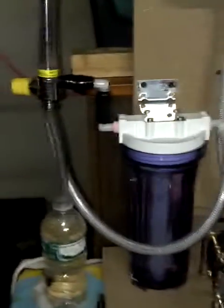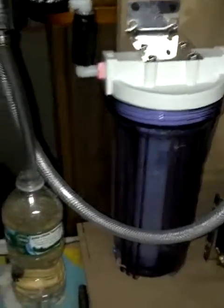Hi YouTube, this is Mark from Advanced Electronic and I'm testing out a hydrogen cell that I built. This is a 21-plate dry cell with a high buffed acrylic outer plate. We have 21 plates, there are four cells in here — positive plate on the outside over here, positive plate on the outside, two negatives and a positive plate on the inside.